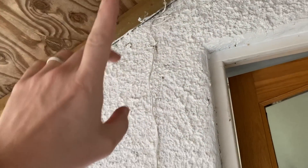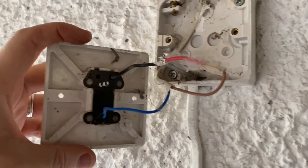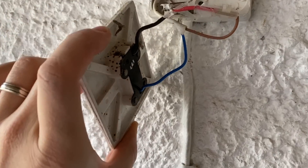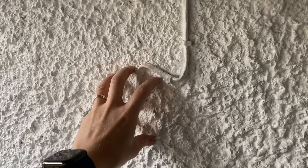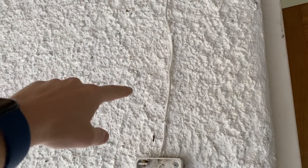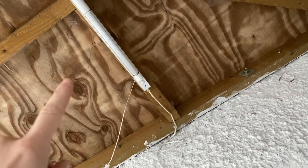I'm going to sort out this light situation. I've just taken the switch off and they've been switching the neutral. I'm going to put a new IP-rated switch directly on here with cable going into the back of it, then run a bit of white PVC conduit up and a circular LED batten fitting to go on there, and just get rid of that horrible thing.